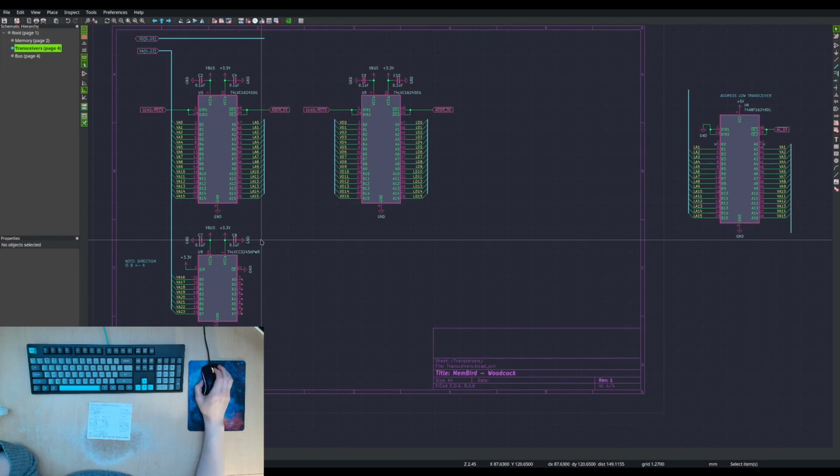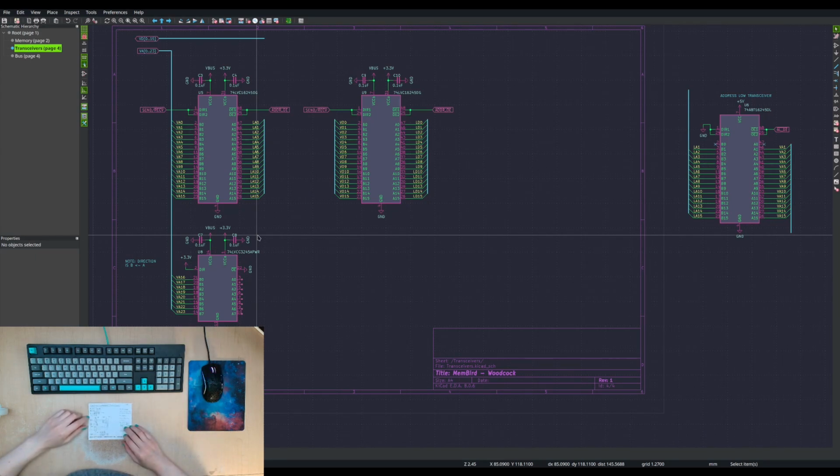I kind of need an uneven amount of buffers, but if I do need an extra one, well, now let me think about this. I am actually going to need level conversion for some single signals. We're going to need a whole bunch for AM. No, we can do the logic in 5 volts, or in wide range voltage. So the logic in here, we could use chips that could be 3 volt or 5 volt, or even populated differently based on the board. And then all of this logic could be whatever. It's these signals that go into there.